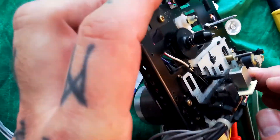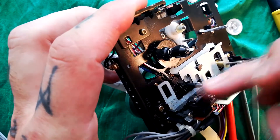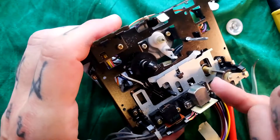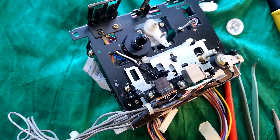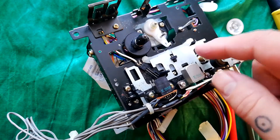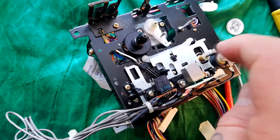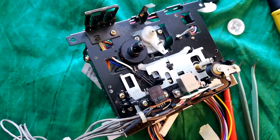The only other thing that might cause performance issues is the pinch roller, but it looks fine to me. I'll probably clean the capstan and the magnetic heads with isopropyl — I won't put isopropyl on the rubber. If it were dirtier I might use very diluted dish detergent or just hot water, but actually it looks fine.